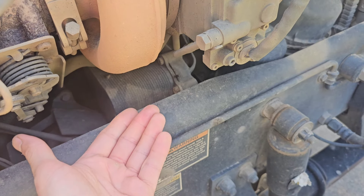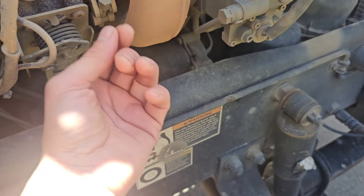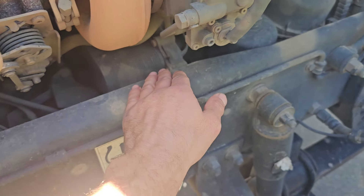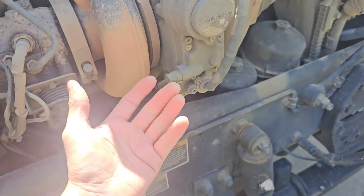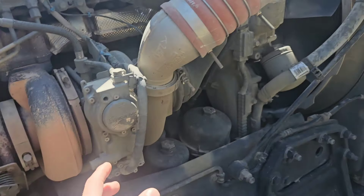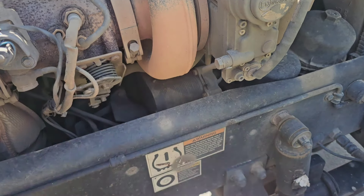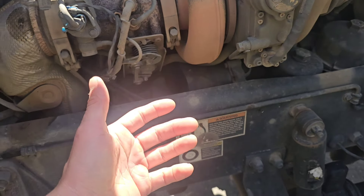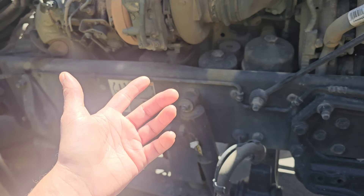What we also have is a heat exchanger. It's not a radiator — what happens is they run oil and coolant side by side in different passages, sandwiched together, so the water absorbs heat from the oil to cool it effectively via the radiator and keep it regulated. I can see a little bit of oil there, so that could also be a possibility.